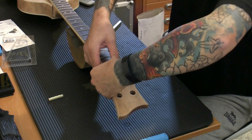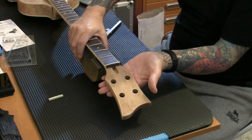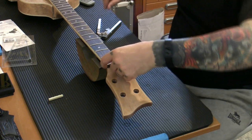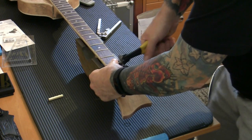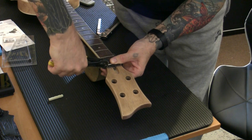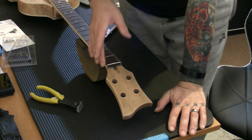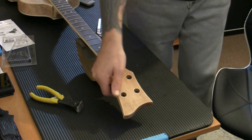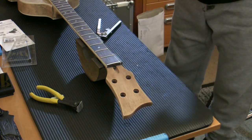Now that fret will fit that slot beautifully — look at that, how good is that. I could just hammer that in right now. I'm not going to, because I need to support this end. I'm going to get this end supported right under this heel and hammer that in. With my fret cutters I can just knock off these ends. This is inside the binding and going right up to the edge of the binding — that is cut really really well. It's going to be a perfect zero fret once it's in. I'll be filing the edges just to smooth them off. I'm going to support underneath, use that on my vice, hammer that in with a little drop of super glue inside.